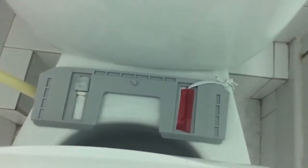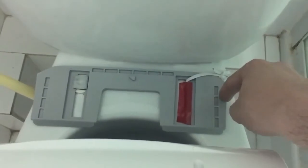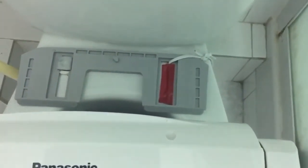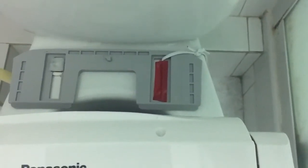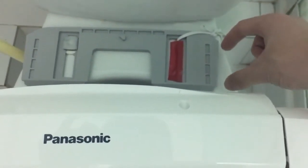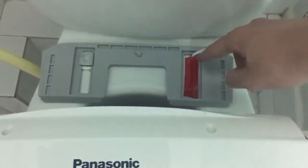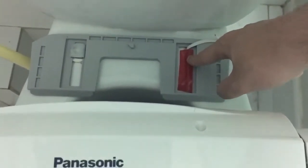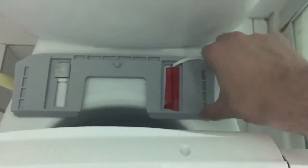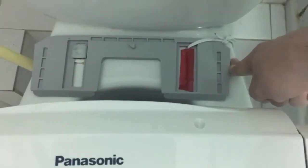But there's something unusual here. What is the reason to have the adapter like this? Well, it's simple — the toilet has two holes, but the holes of the adapter don't match this toilet. So I had to think of something to fix it. First I thought to put a cable inside the hole and the adapter to fix it, but it didn't fit well enough and the toilet was moving when you sat on it. So I decided to use a strong adhesive tape — half on the adapter and half on the toilet.